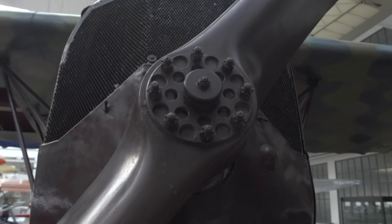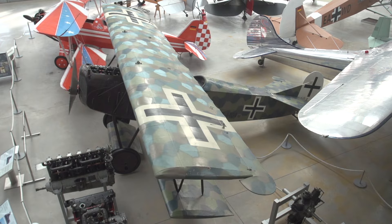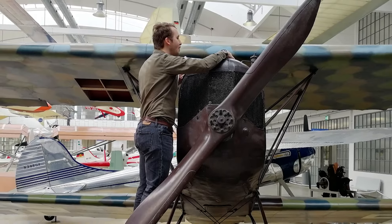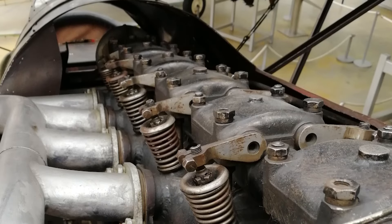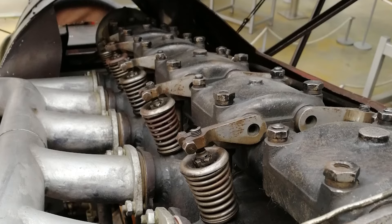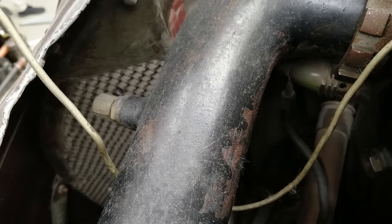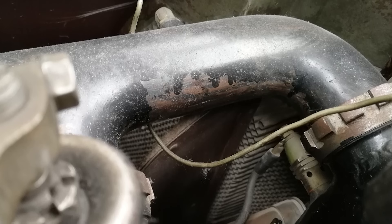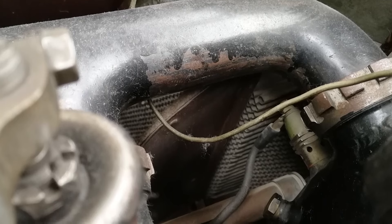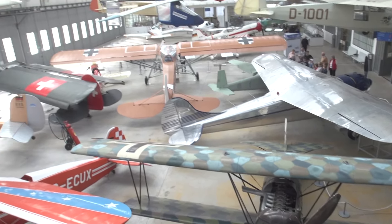This is where we make a short unscheduled excursion. After finishing filming this episode, I wanted to see the engine section in a bit more detail. The museum is 99% sure that this aircraft was built in the Netherlands by Fokker in 1919, so I asked for a ladder and measuring tape and had a look inside. I suspected that Fokker did incorporate some of the changes made by Albatross at some point in the production run of the D7 — that would make sense. His initial production run only featured a closing radiator flap on the starboard side. In this aircraft, after having a closer look, I also found one on the left, the port side. It does suggest that the aircraft here might have benefited from similar modifications that Albatross had made.